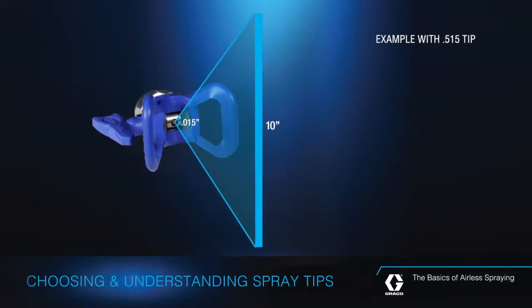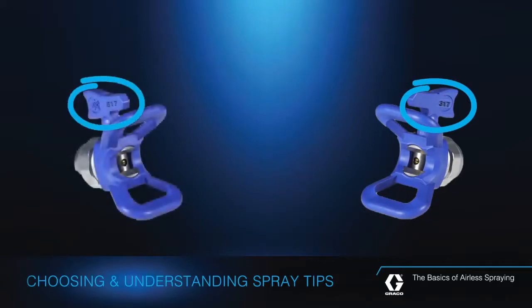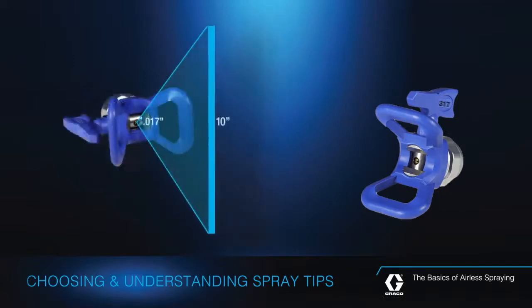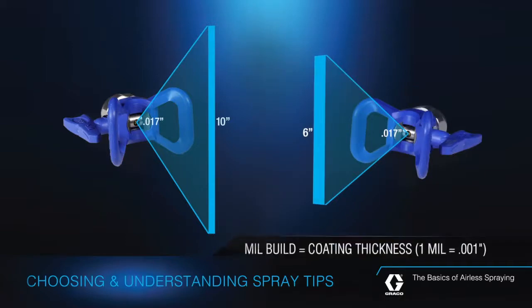It's the combination of fan width and orifice size that determines how thick of a coating you'll spray. Case in point, a 317 tip and a 517 tip. Both have the same orifice size, 17 thousandths of an inch. But the 517 tip sprays a 10-inch wide fan, while the 317 sprays a 6-inch wide fan. Because the same amount of paint is leaving the orifice of the spray tip, but being dispersed across a wider fan, the 517 tip will deliver a thinner coating with less mil build.